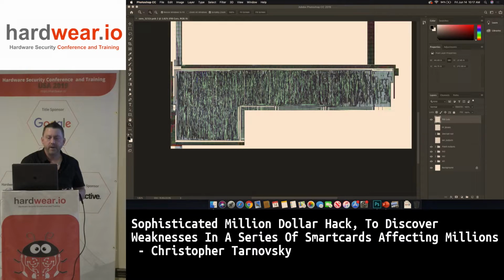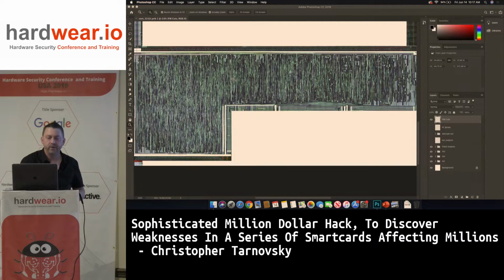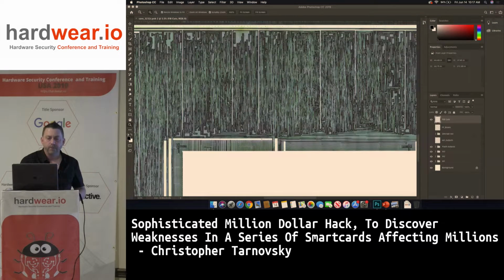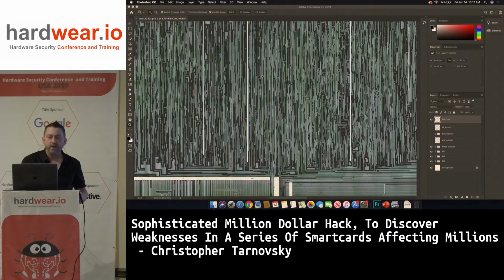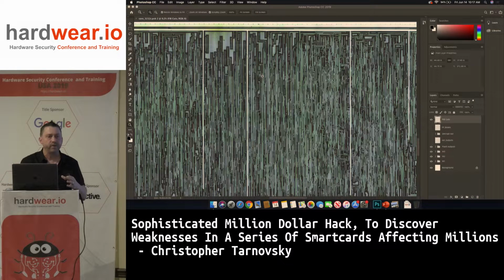So here we go again. Same thing again, optically imaged. Now, this chip came out in probably 2000, 2002 maybe. This is an old device, but Atmel's been doing fully synthesized cores back when ST, for example, and Infineon were still doing a microcode core, like I talked about earlier, where the instruction registers point into a table. And in Infineon's case, the table was like the address into the microcode to run from for a jump or for add or for subtract.